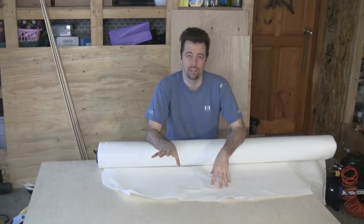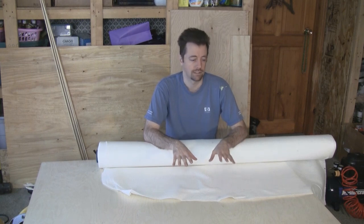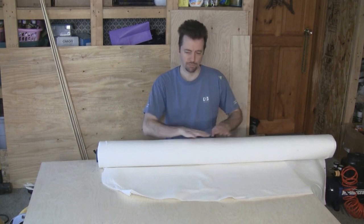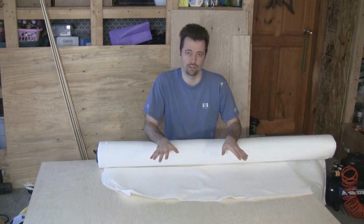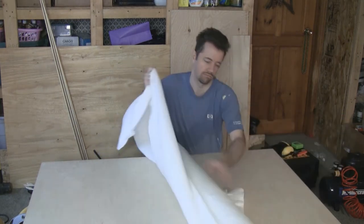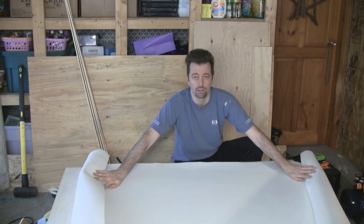We're now going to apply the adhesive to the MDF and then bond it to the foam for our playing surface. I'm going to spread the foam out on the birch plywood first to make my life a little easier. We're going to spray the MDF outside because the adhesive has a very powerful smell, and then we're going to bring it back in and press it down on the surface while the glue is still tacky. If it's curved from being in the packaging, make sure the curve goes up so the edges will bond really well, and the weight we put on the middle will keep the MDF glued down while the glue sets.